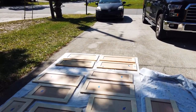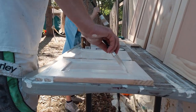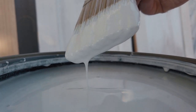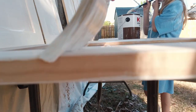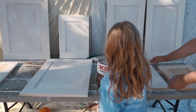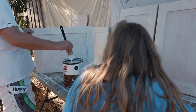Because I have built new doors in my workshop I am dealing with a raw wood surface, so a good coat of primer is essential. This is the one aspect of this process where I do use a brush. I want and need a good thick layer of primer to help fill in the wood grain and create a nice smooth surface for the paint top coat to adhere to. Oak is notorious for showing wood grain through paint, and unfinished wood also tends to be thirsty — it soaks up a lot of paint. A good primer is just going to help even things out.